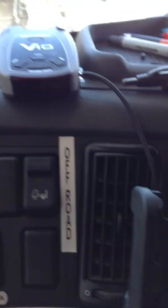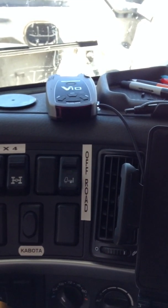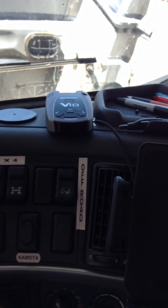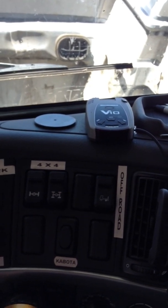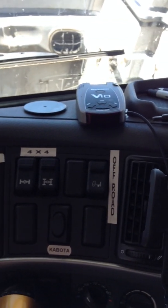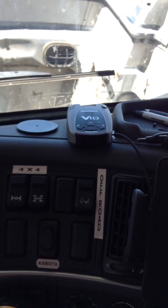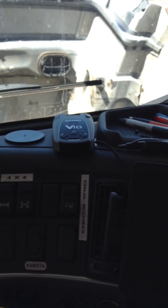The off-road package raises the truck from normal ride height about 5 or 6 inches. You use this when you need to get in and out of parking lots where there is a dip. This is a very low speed operation — 5 to 10 miles an hour only. It takes approximately 3 minutes for the off-road package to air up and raise. I will show a clip at the end of this of how this works.